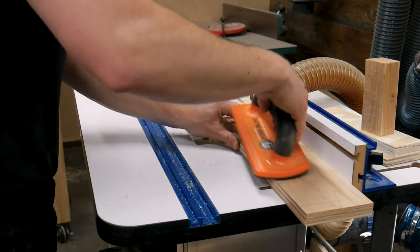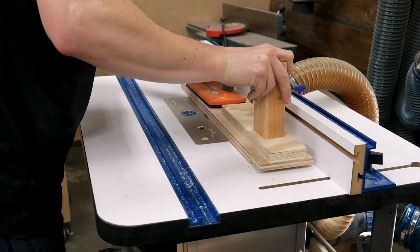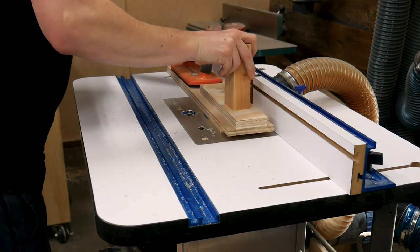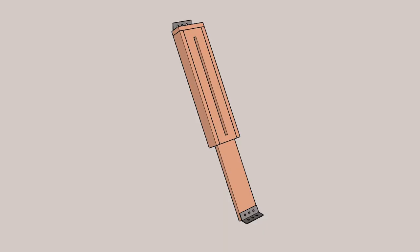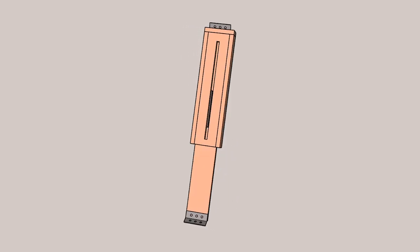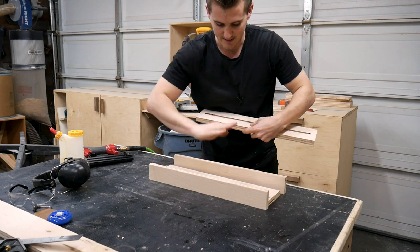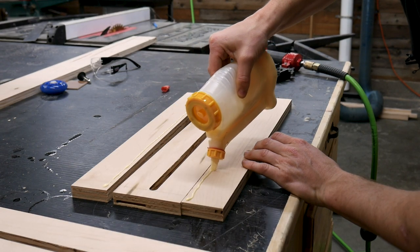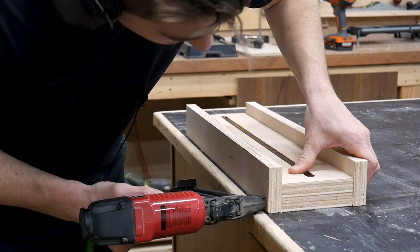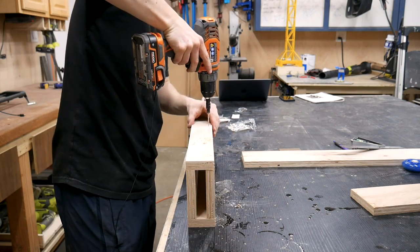The way I'm doing this is I'll raise the half-inch router bit up a little over half the thickness of the three-quarter inch material, route that channel from left to right, then raise the bit up to just over the thickness of the plywood and route the same channel again — that gives me a nice clean groove down the middle. The assembly consists of two side pieces and the two routed pieces sandwiching a sliding mechanism, which is just another piece of plywood. Once assembled, I'll go back and add screws at all these places to really firm things up.